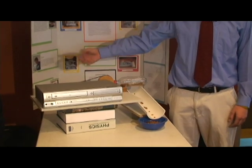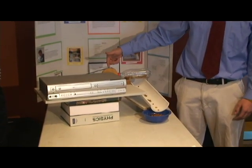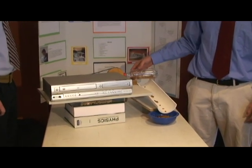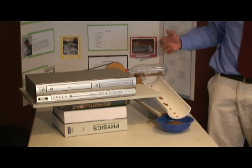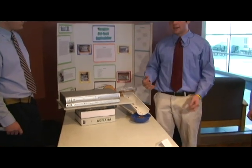The way we did that is we took out the VCR reel in the back of it and connected it to an o-ring that spins a wooden wheel. This wooden wheel, through a gearbox, will turn a bottle, and the bottle will dispense food as it reaches a hole every time it goes around.